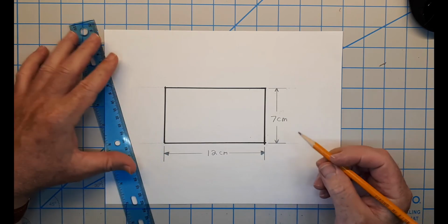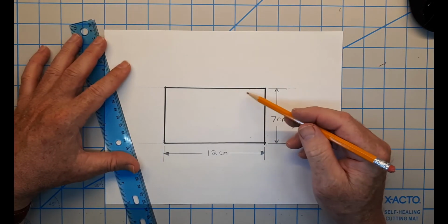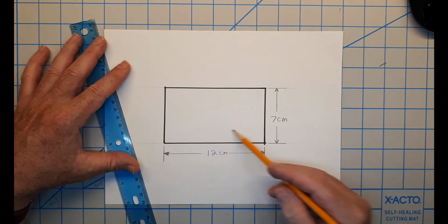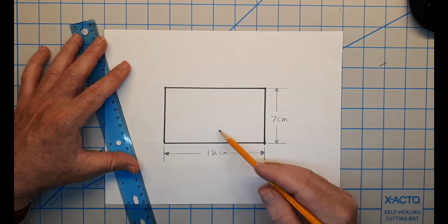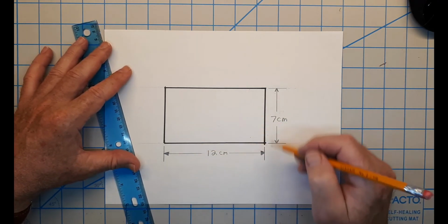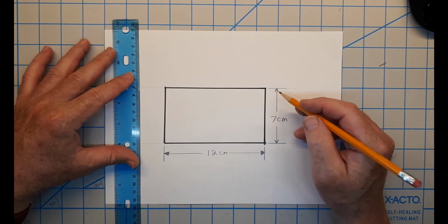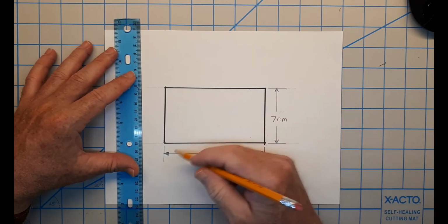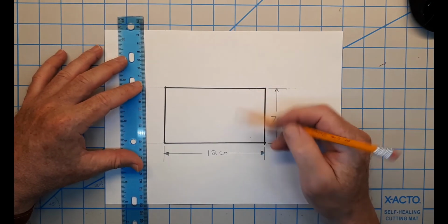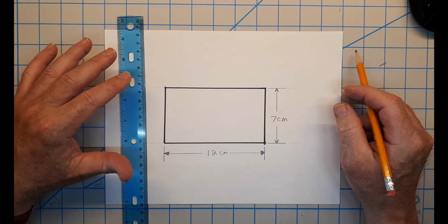But you do need to have an arrow because it does have to indicate from where to where. But sometimes it gets confusing if you draw a line here and a line here, because then they cross. And then it's just easier to do it on the outside. It's good practice to get used to doing that. Most engineering drawings you see, or quite a few of them, will have lines on the outsides wherever they can. There are cases where you have to do it in the middle because there's just no room on the outside.